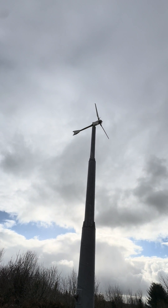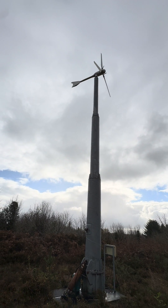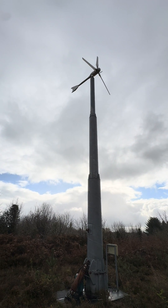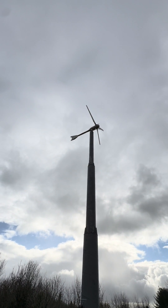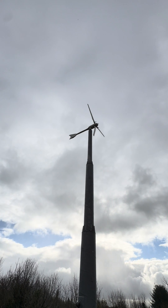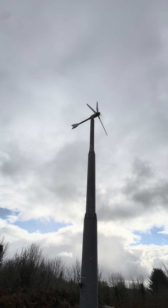These are a nice basic mechanical wind turbine. This one has been here for nearly 10 years now. I had it down about a year and a half ago to replace bearings in the hub. So potentially now there's a bearing tightening up in the generator, and that's the reason it's not spinning.